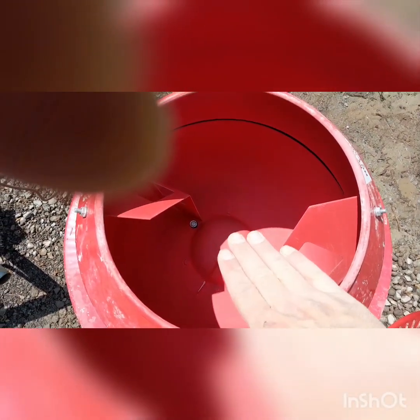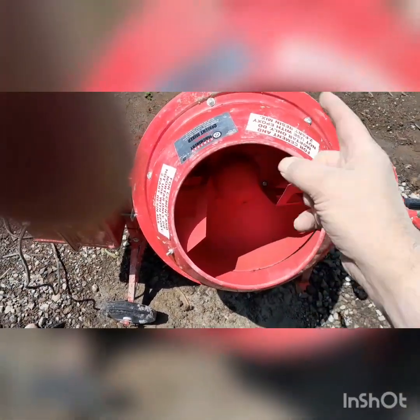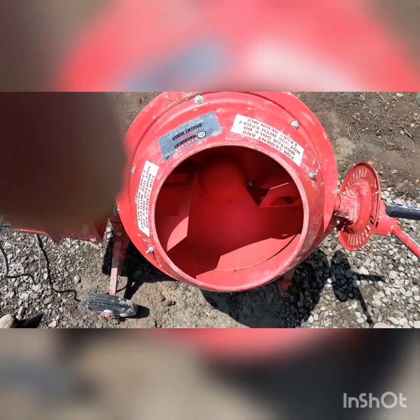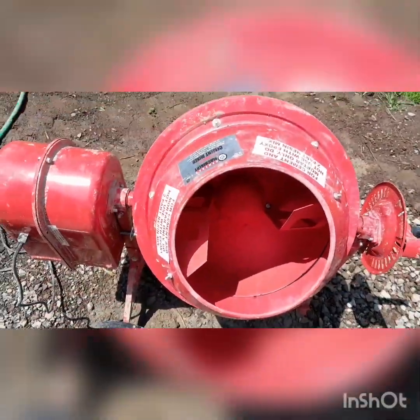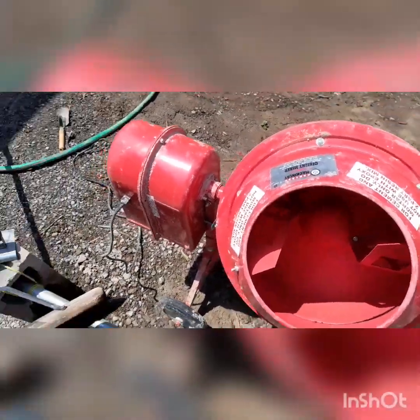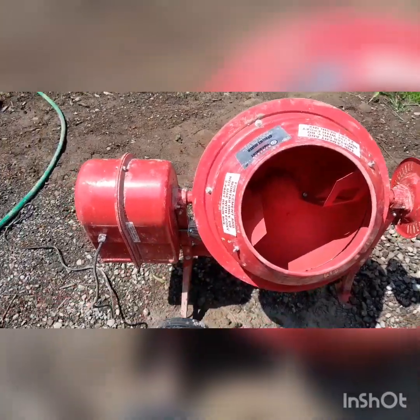And yeah, now you can see it. I would just get the water to above there, put it on the first notch, start it, and now all my water's sloshing in there. Take a bag of cement, cut it in half, start pouring it in there until I saw it getting thick. I did pour it a little watery because I had to do all of that and I didn't want it to start drying before I got finished. So I made it kind of soupy. I hope it doesn't ruin the project.